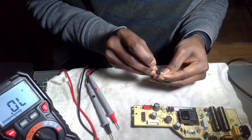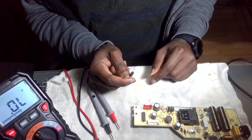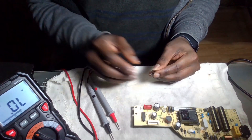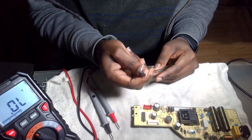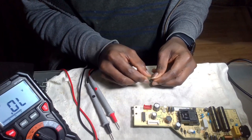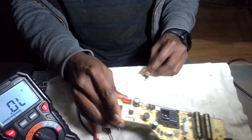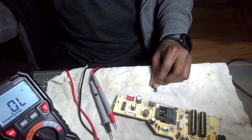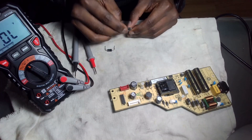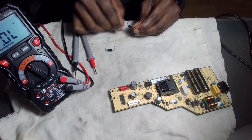This is a MBR3200. I'll look through my stuff and see if I can find one that has the same specification. I might not get the exact same thing, but I'll do a search online to find something with the same specification — you have to get the same type of diode. I found one here. I did a search on it and they have the same specifications. Okay.